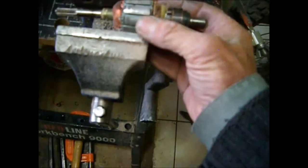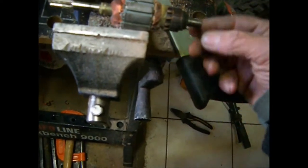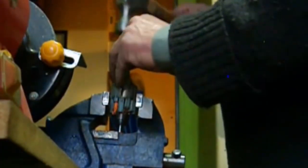How to get the copper out of electric motors. In YouTube you can find a variety of ways of getting the copper out of electric motors. In a previous video I showed you the best way to get the copper out of the rotor of small electric motors — cutting one side with a 24 to 32 teeth per inch saw and pushing the rest of the copper out with a steel bar.